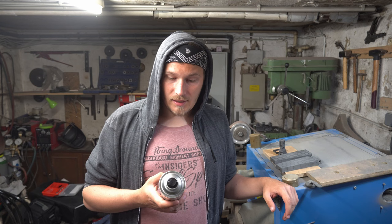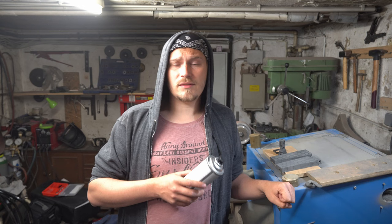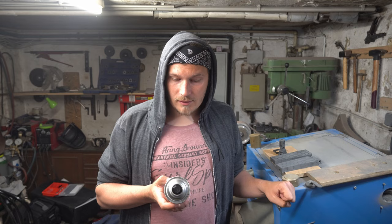Basically, you're just looking for a black that's completely matte and quickly drying, and has absolutely no glow to it, like clear coat glow. And a lot of colors that do that are, for example, barbecue or oven spray paints, high temperature spray paints. They usually don't have any acrylics in there, and you can experiment with those.